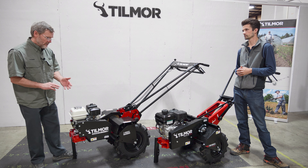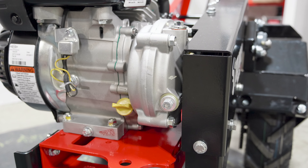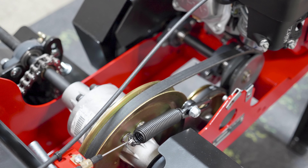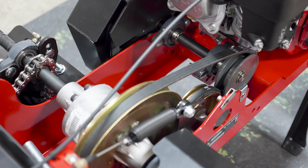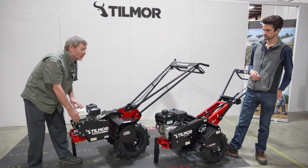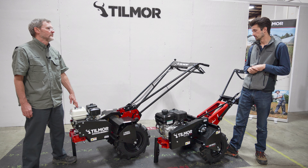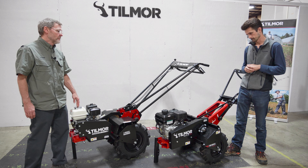In doing that, the other thing you'll notice: the Briggs and Stratton had the six-to-one gearbox reducer. On the new design, we've been able to accomplish that speed reduction through a series of pulleys, and that's allowed us to eliminate that gearbox, center up the engine, and provided some other benefits to the whole system. There are fewer engines that have the six-to-one reducer available, so one benefit is future repowering options. And there's no need for maintenance on a gearbox.